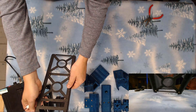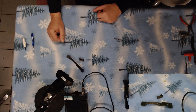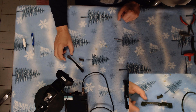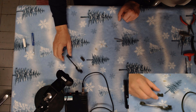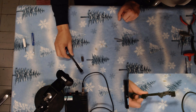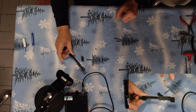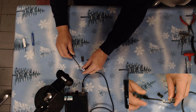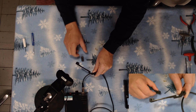And that completes installing heat sets in our slide tray. After going through everything I realized that I missed two pieces in the layout — they're part of the plug mount used for holding the wiring and everything in place on the slide tray. This piece here gets four heat sets: two here, one here, and one here. We'll go ahead and put those in real quick.